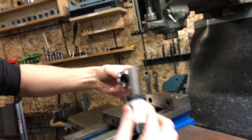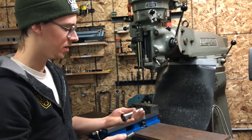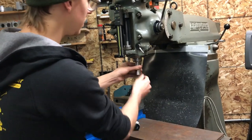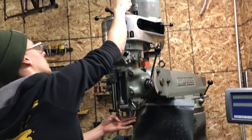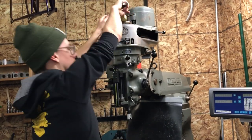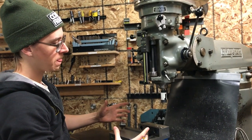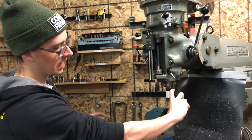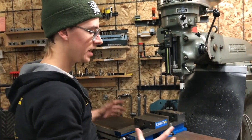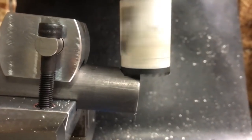This collet is for a three-quarter inch shank, which is the size of these arbors — about the largest you can fit on this machine. A three-quarter inch shank works great. You put this up into the spindle of the machine, put your tool up in there, and it's real tight and rigid. You get a lot better contact — it's just a lot more rigid than if you had a drill chuck projecting three or four inches with a dinky little shank sticking out. It's more rigid and it allows you to take advantage of the heavy nature of the machine so that as the teeth catch on the tubing during the miter, it's not going to get hung up. It's going to plow right through.